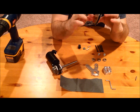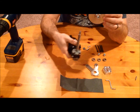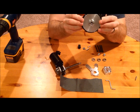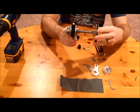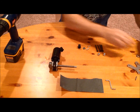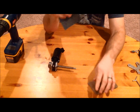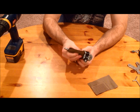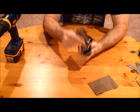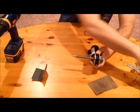I've used my Allen wrench and separated the wheel a little bit. This mounting system is neat — once you get the wheel on the shaft, you screw these in and it'll lock the wheel right on the shaft. But at this point, the hole in the wheel does not quite fit the shaft; the shaft is just a little bit too big. So we're going to start by taking a piece of sandpaper — I've got 180 grit — and put it on the shaft and evenly sand the shaft down.